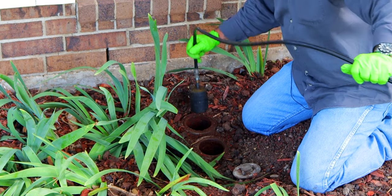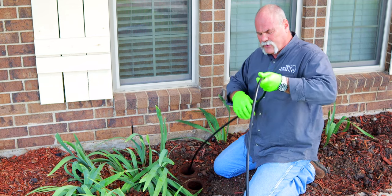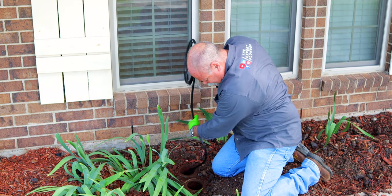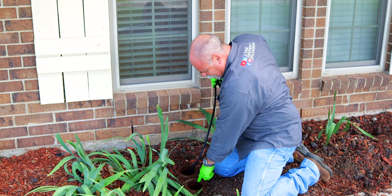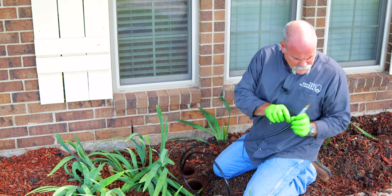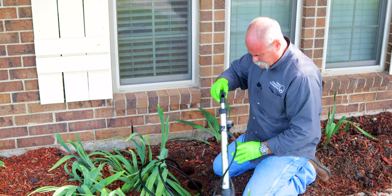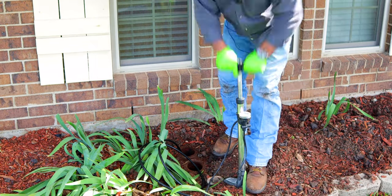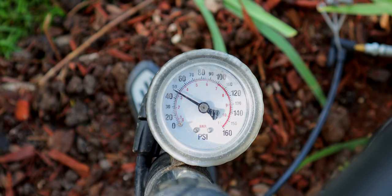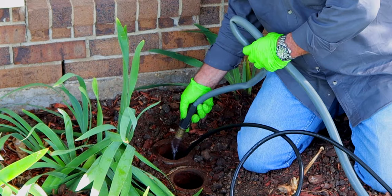I've got a 3-4 test ball here and I'm going to stick it in. I want it to turn and come back this way so I can see where my water level is through these cleanouts. I'll roll my hose up and twist as I push it in. I can see it going through. We put wax on them to help seal them so when we fill it we know water won't leak past it. Now I'm going to pump it up — holding at 45 pounds. The test ball is in place, hose hooked up, water turned on, so now all we've got to do is fill it up.